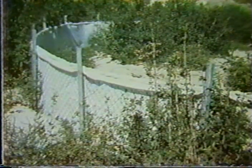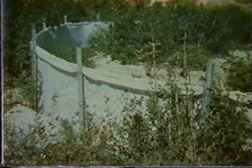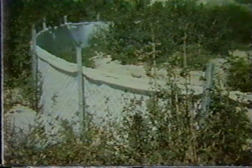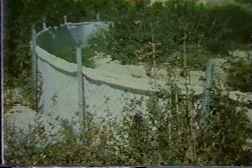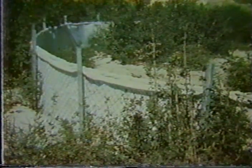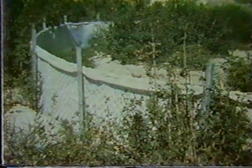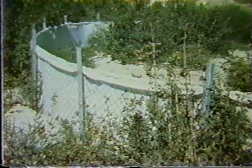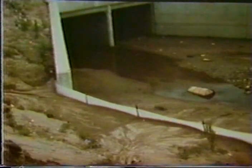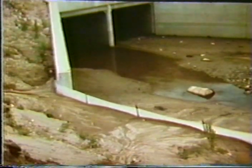agencies have experienced. Now, for erosion control, a number of agencies have used fabrics, erosion control fabrics, and erosion fences, as illustrated here, to catch runoff from projects either under construction or whatever, any areas they might have problems with. Here we see a fence that's set up with a chain link and then fabric on one side to catch this erosion. In this application, you see where one of these fences is almost going to be overtopped.